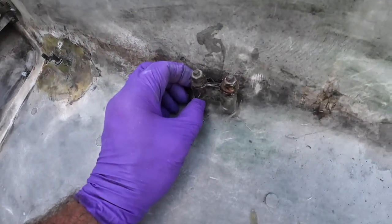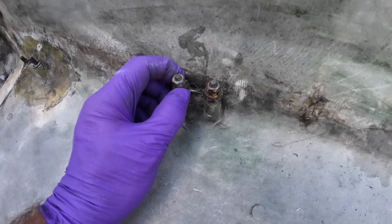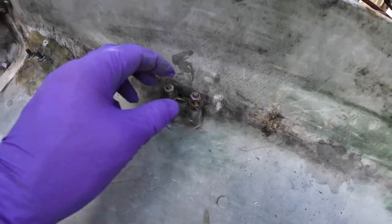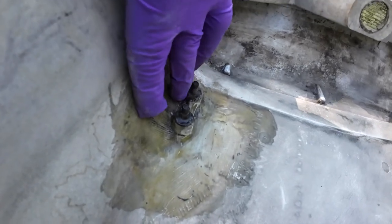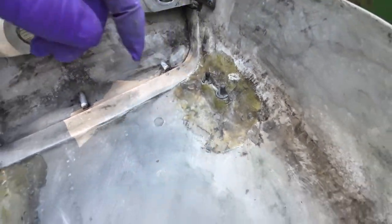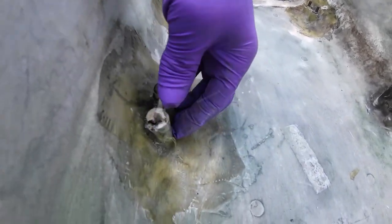On this one, I just poured resin into the holes because these are still stout but the holes are stripped — I just filled the holes up with resin and then ran the screw down into it, and those feel pretty good. One last thing I want to do is kind of have a pocket on that back side. I want to do it to the rest of them — mix up a little bit more and fill in that back side so it's got a little more strength. And I need to get this bolt installed.